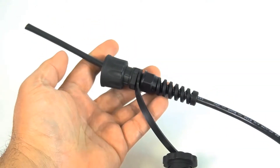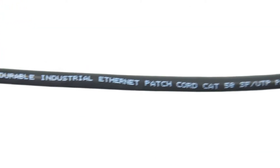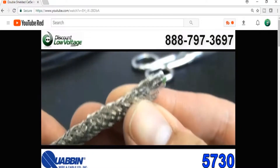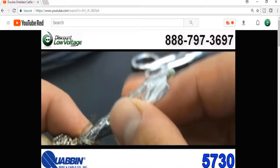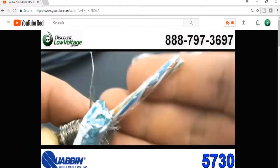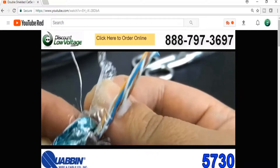The other thing I do want to mention: if you're using an industrial connector, you're probably going to want to use an industrial type of cable. We do have these available online, sold per thousand. You might want to check out our YouTube video for more information on what's under the jacket and what else is available. That's what you want to use in environments with oils and all kinds of other stuff. A plain Cat5 cable probably won't last a long time for your type of application if you're using this type of industrial connector. Something to think about.